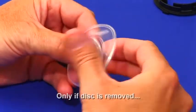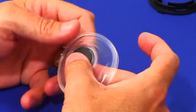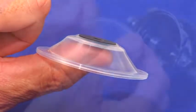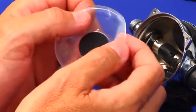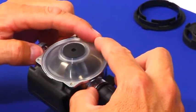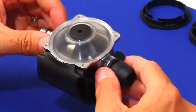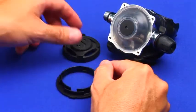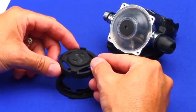If the disc was removed from the diaphragm, return it. Hold the center of the disc, feed the diaphragm into the midsection and into the disc groove. Inspect to be sure the diaphragm is not distorted and check for previous folds or creases on the diaphragm lip. Any imperfections found merit replacement. Be sure the entire circumference of the diaphragm is laying flat and into the case diaphragm groove. With the outside of the ring tab at 6 o'clock position, press the cover into place orienting the bottom of the S logo towards the tab.